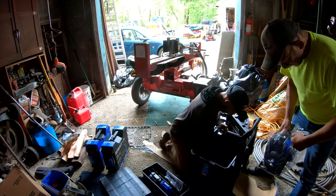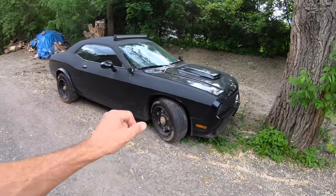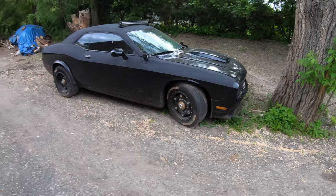There's the charger. I'm going to jump in here because I want to just kind of break something down for you. When it comes to batteries, they're all basically the same — well, they're not built the same, but they're the same when it comes to volts and amp hours. The volts is the power that the battery delivers. The amp hours is the run time. Using a car analogy: the volts would be the size of the motor, and the amp hours is the size of the fuel tank. So on these tools, they're delivering massive amounts of power, but not necessarily massive amounts of run time — meaning you'll have all the power you need but may be going back to the charger more often.